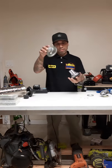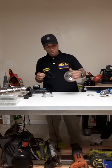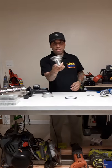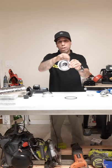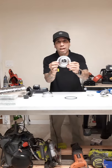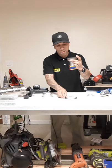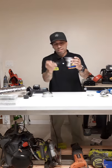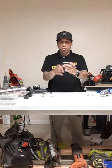This other piece here is the famous rubber gasket. This is part of the basket — the part that goes into the sink. On this brim here, you guys love to put plumber's putty, but plumber's putty is not good here. This black rubber gasket comes with the kit, and this is what you need to use. Let me explain to you why.